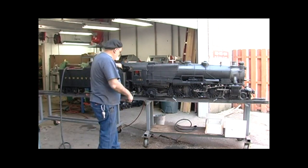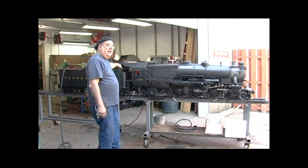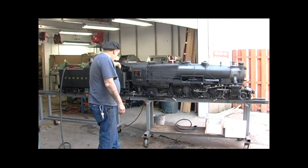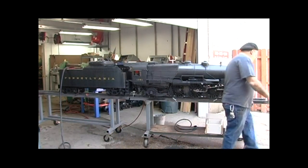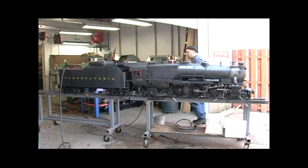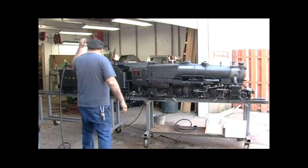Now I always check the injectors to see if the water comes out of them. If not, you've got to take them apart — there's a little cone in there you've got to release. One of these days I'll do a video on how to clean them; nobody else does. Still got the drain open from last year — close the drain. I also have an overflow built in here. It's a good idea — about a half inch from the top of the tank, one-inch pipe welded into the stainless steel tank. It just comes right out, no problem.